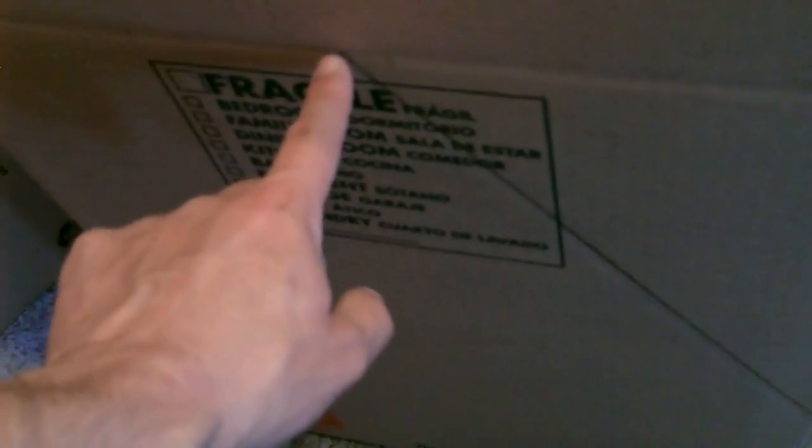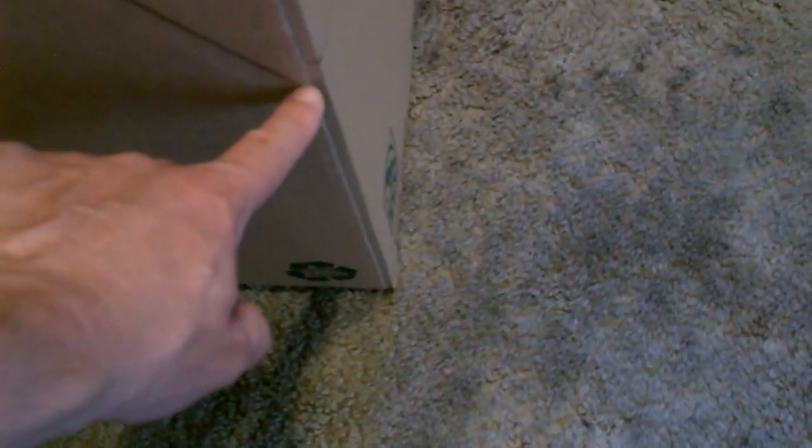So what I did — it's 18 inches wide. I measured exactly halfway across, so that's nine inches on each side. I drew a line exactly 16 inches down, then I measured a line that runs straight across from the bottom of the box to the end of the slanted part. This distance is about 11 inches, and the line I drew across is 11 and a half inches. That'll provide a little lip for the glass to lay on so it won't slide off the front.